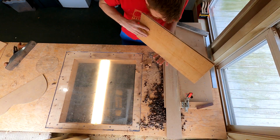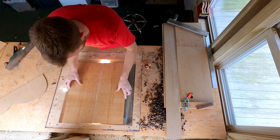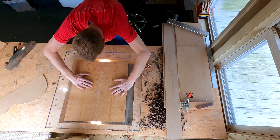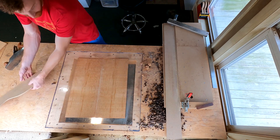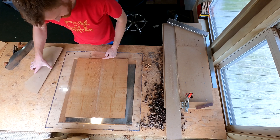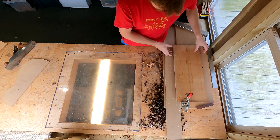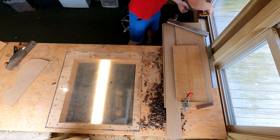All right, let's have a look. That looks great. I'm ignoring the very top piece — there's a portion that's getting cut off anyway and won't be on the guitar. From there to there it's perfect. So that looks good. I'm going to tape it in alignment. I like to place it on the shooting board to line it up, then place a couple pieces of tape to hold the bookmatch together.